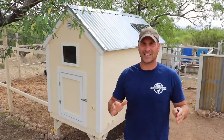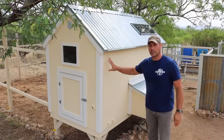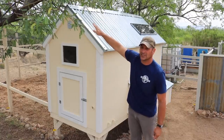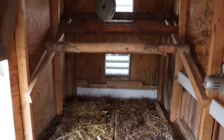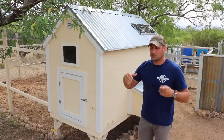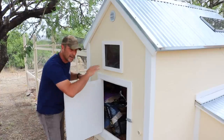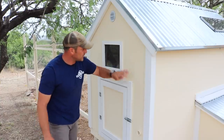The general dimensions of this coop are almost completely full sheets of plywood, so each side is four feet by eight feet, and then the ends are a full sheet of plywood four feet wide, positioned vertically with the roof pitches cut out — that way I could get the maximum use out of all the plywood. The floor space is exactly a four-foot by eight-foot sheet of plywood, and all of the framing inside is just standard stick framing using two by threes, much like you would build a house or a shed. This is my main entry door where I access the coop most commonly — I store my feed over here. As for the trim, I used almost all one by threes or one by twos.